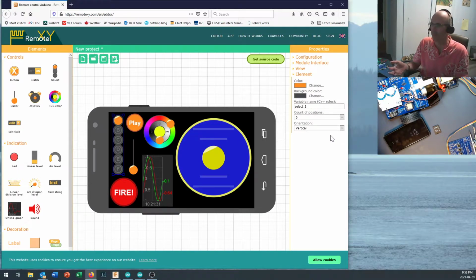You can have a random sound on startup if you've got lots of different sounds. You could have it read out status reports on your battery, and you could have an MP3 file that says the battery is, and then depending on the state of the battery, you could read the analog pin that the battery is hooked up to, and you could say good, okay, or bad. So you can play around with the sound effects quite a bit and get pretty creative to give you status reports.